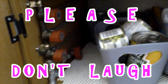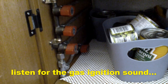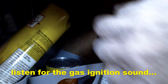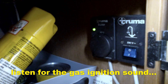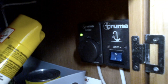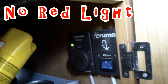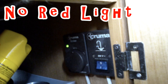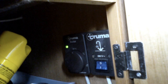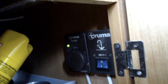Oh hello - I've turned the gas off! There we go, that should help a bit. Let's try now. Here we go, fingers crossed. Let's see what happens now. That lit - I heard it! So that's it - blow it out with an air duster, and that should solve your problem. And it also helps to turn the gas on! I better go and check it because I haven't got that cowl on at the back - I want to make sure there's no problems.